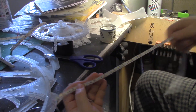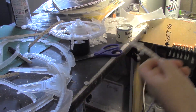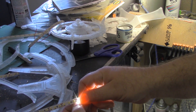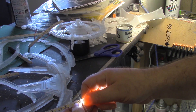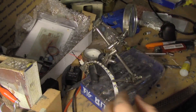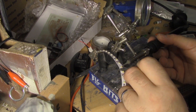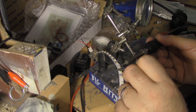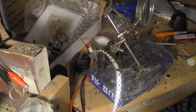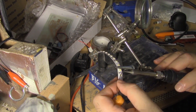In that case, all you have to do is jump wire from one segment to the other on each of the contacts with a bit of solder. Let me demonstrate — if I happen to cut here and we apply power, all of a sudden that section is not there. First I'll just try putting a little blob of solder in there and see if that makes the connection or not. Nope. So next we'll try just blobbing a little solder in between each of these contacts.